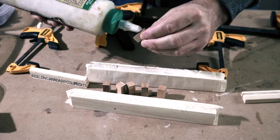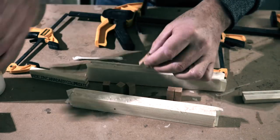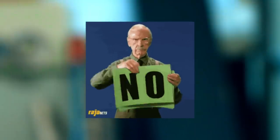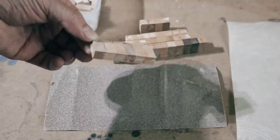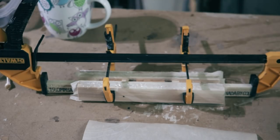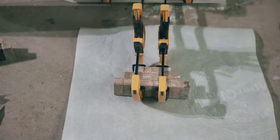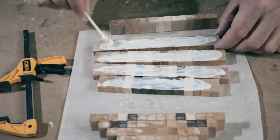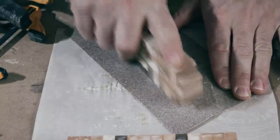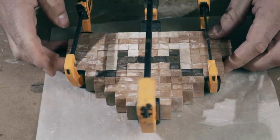That's a nice looking row of pixels. On to the next row — want to spread that glue smoothly? Use a Q-tip. If the grain direction on these pixels matters to you, this is the time to apply that oversight. I like to glue the rows of pixels together in stages. They should be pretty flat, but on a piece of 80 grit sandpaper it can't hurt to gently remove some excess material. So while my individual rows of pixels are gluing up, I'm also busy assembling the greater Goomba. No special jig for this — just line up everything by eye. I've always found it really rewarding to work on projects that have a lot of small pieces that have to come together. It could be my painting background — in painting I'm used to assembling hundreds of shapes. Here I'm assembling a hundred pieces of wood. Different medium, but same temperament. Equally possible I just enjoy torturing myself.